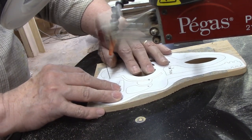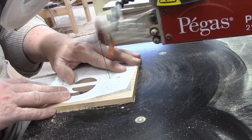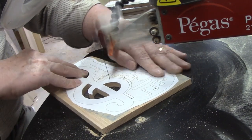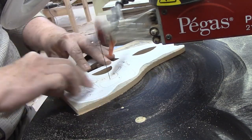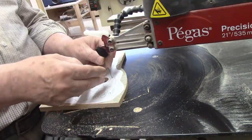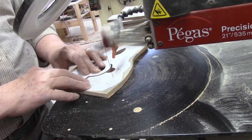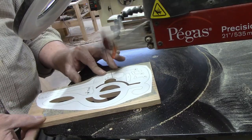This is an unusual shape, but there's nothing difficult to cutting it. From the pilot hole, I cut across the waste area to one of the long lines. I followed that to the bottom where I had to make a 90-degree turn, cut a short straight line, then made another 90-degree turn. I followed my standard procedures for making these turns. The rest of the cut was a mix of angles and curves. The next interior cut creates the shape for the pick guard. This shape is all curves and cutting it is a straightforward matter of following the line around until the cut is complete.